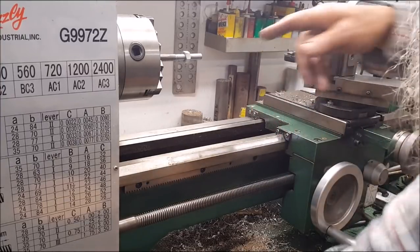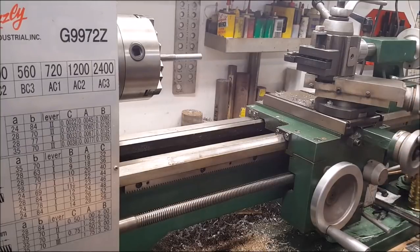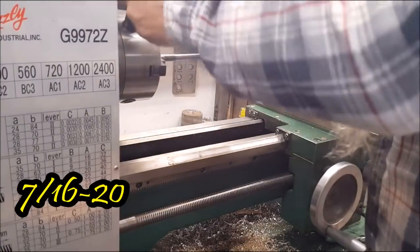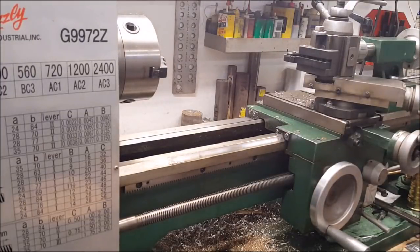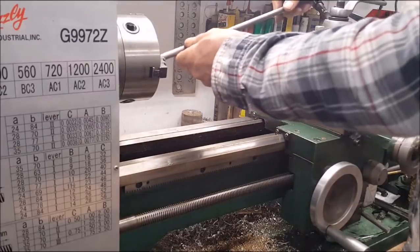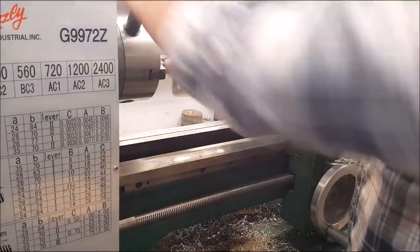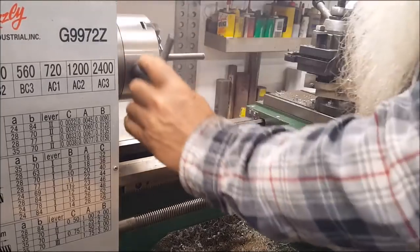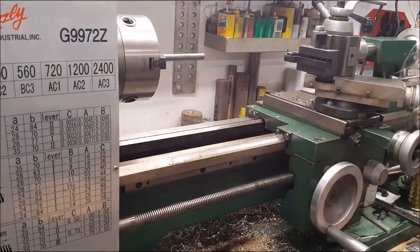On the Doug Thornhill engine, I'm going to make a new one. It's a 7/16-20 thread, and I thought I'd just go ahead and make two of them. This is 8620 steel — if you read about the specs on 8620, it's got some good properties, it's not very expensive, you can hammer on it and shape it, it forms pretty good, you can bend it, and you can weld it extremely well.